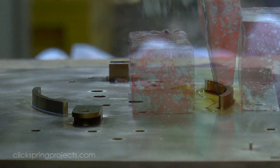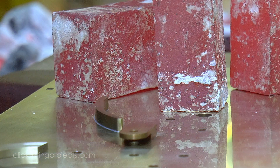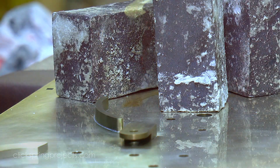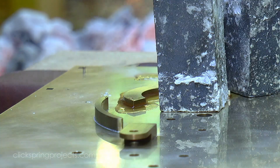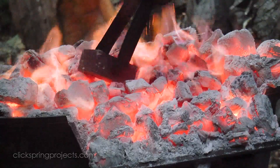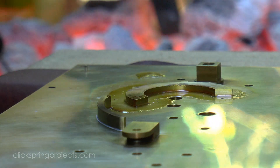For the larger pieces, it also helped to break the job into two parts: first by heating up the plate enough to flow the rosin and then dropping the part into its general position. At this elevated temperature, the rosin stays tacky for a few minutes, allowing a more careful positioning of the part, after which the hot tools were returned to run the solder into the join.